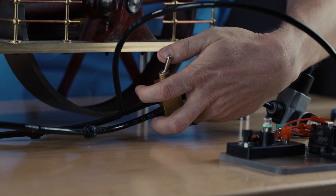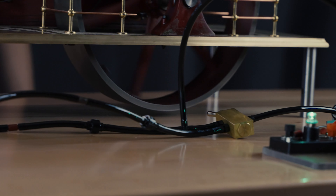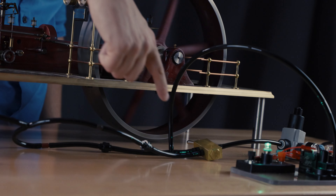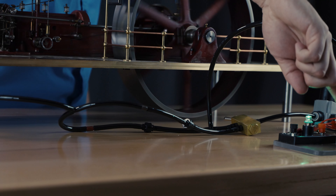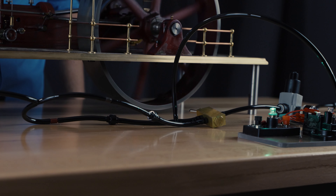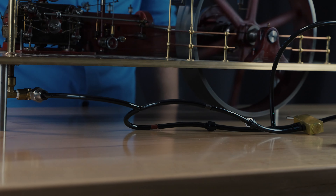When I toggle this valve, we're going to get the fast speed. All right, really cooking here. Now the air pressure is coming through this other line. The pressure switch is detecting that we're at the high speed, and the larger orifice is letting the system run faster.